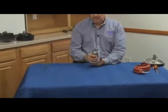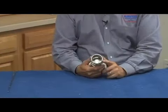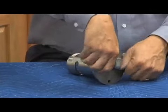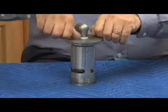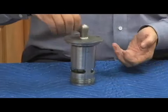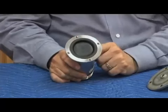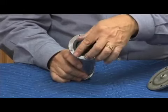on the bottom. We know that an O-ring seals it into the body here. Let's go ahead and take the relief valve apart. Go ahead and remove the cover. There will not be spring tension coming up from the inside when you take the cover off. But what you'll see is a rolling diaphragm like this that we have to pull out gingerly.